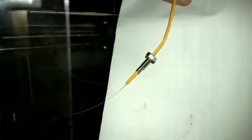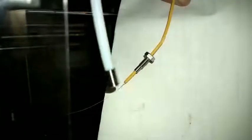Okay, so that's what it is. Hang on a second. I'll attempt to focus this better. Okay. That's more like it. So basically it's a hollow threaded screw that goes into the end of the Bowden tube, which is there. And what's happened here is that the end of the filament here is too big to get back to the thing. So, oh, there we go. It does work now. So that was getting jammed up in there, which is a bit annoying. Let's pull that out because it's just gone down the bottom of the Makibox.